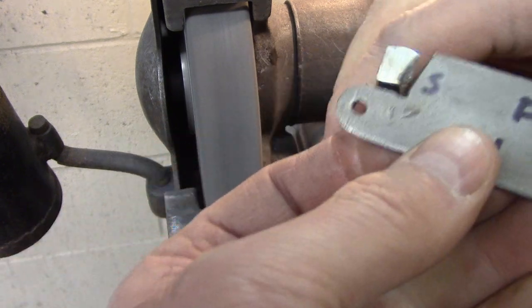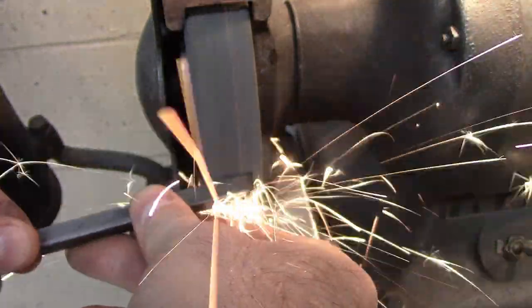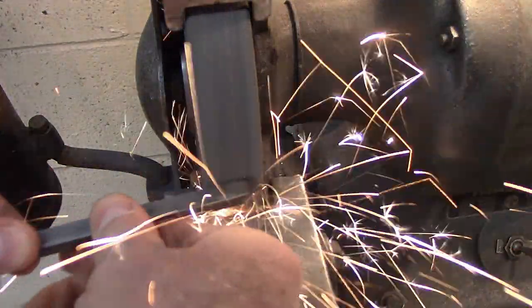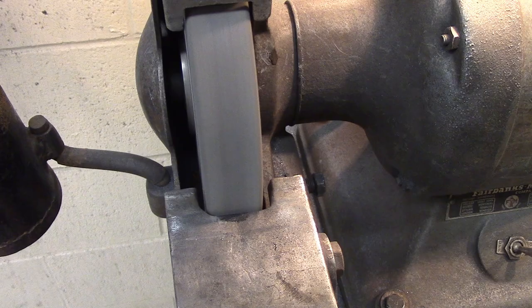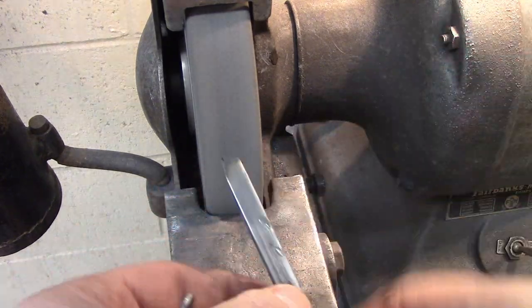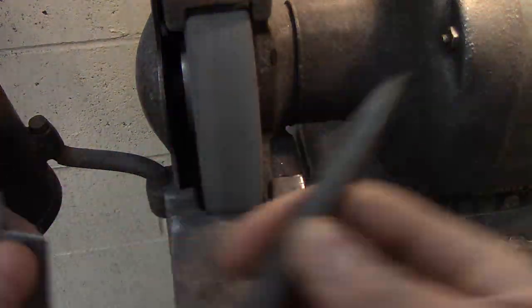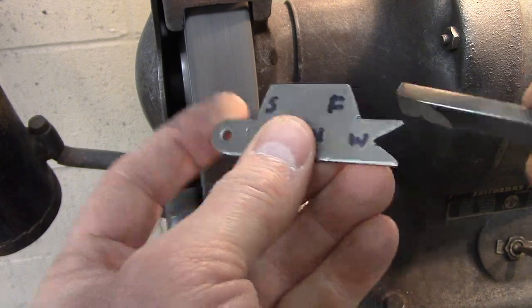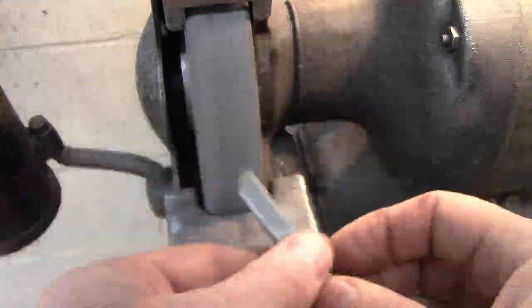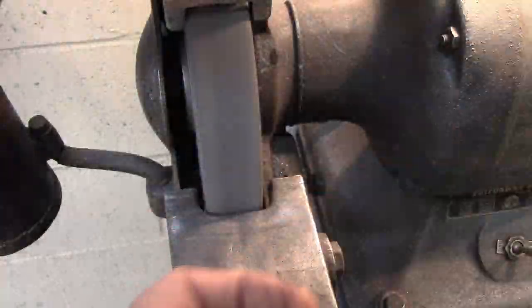The second angle is the side angle and the other half of the nose. The face and side angle give you back rake or relief, so the cutter can actually do the cutting for you. You want to make sure your gauge gives you the exact angle, but if you don't have a nose angle that's tighter than 90 degrees, you can never cut a 90-degree shoulder. How I start the face angle kind of dictates what I end up doing for the side angle.